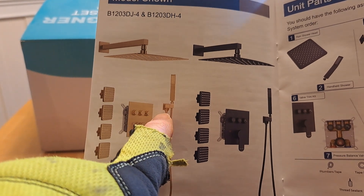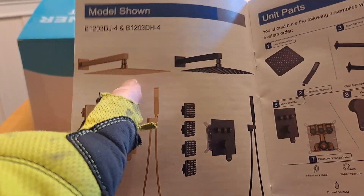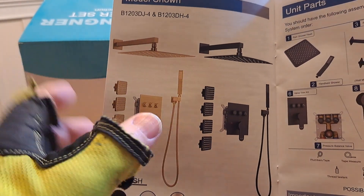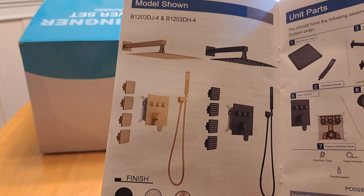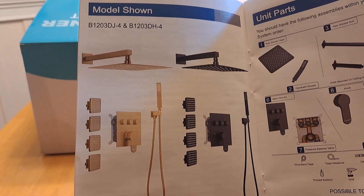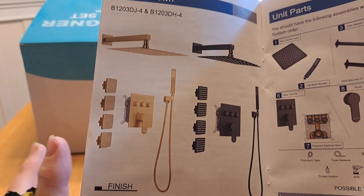This handheld I'm not going to be using all the time. I'm going to be using my big shower head — that 12-inch — and this is a 10 by 10, so this is going to go into my guest bath. I'm thinking four is plenty. I'm probably going to have the rain shower and these four body sprays on at the same time. It's going to remain to be seen how much water pressure I have — I only have 40 PSI for the whole house, which is residential water pressure. I was hoping for higher, but I gauged it when I put my filtration system in.